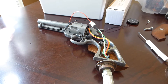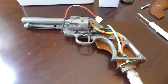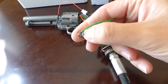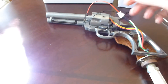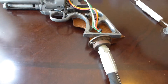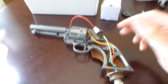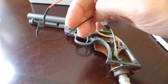I've been stressing over getting the gun fixed, so I decided to just go ahead and take care of that. This is the old broken switch that was in there — the switch actually stopped working totally. It smashed it. So what I decided to do is just wire it, make this so that I could replace it easily if I need to. The gun comes apart really easily — it has a screw here for the handle, and then the other pieces just screw right on. It is kind of a pain to desolder things, so I just added this little connector piece here, and then I added the switch in line with that.